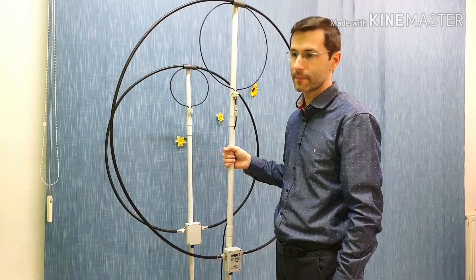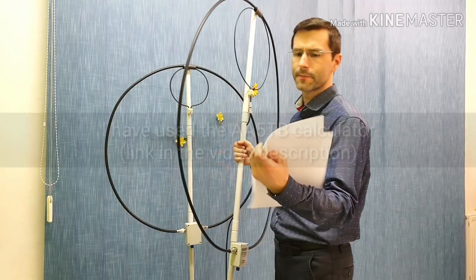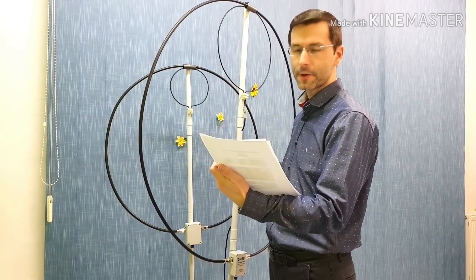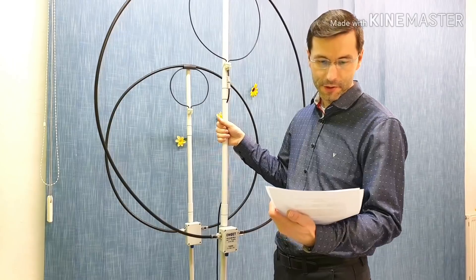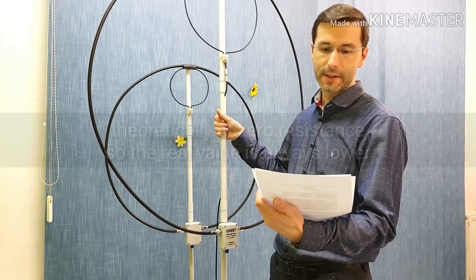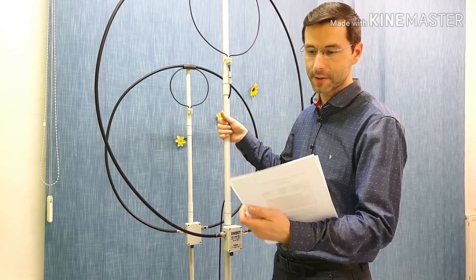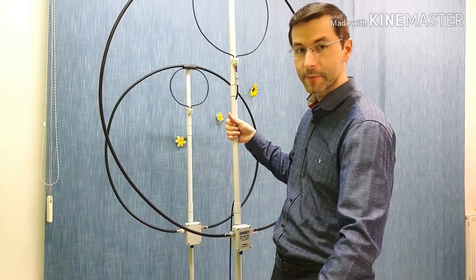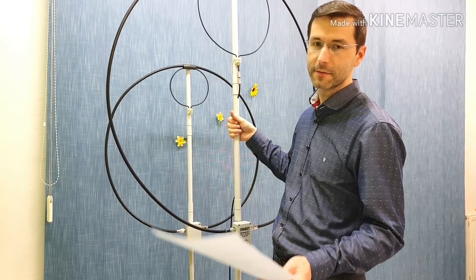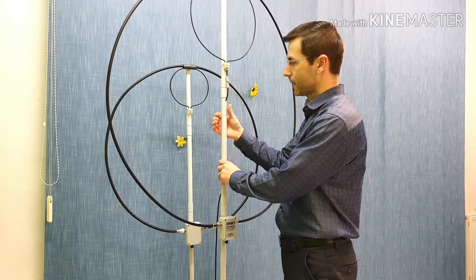The efficiency of antenna version 4 must be bigger because of the construction and the larger dimensions. By the calculations I made on these antennas, at 14.2 MHz the efficiency will be about 97%. That's quite good for 20 meters. And for 7 MHz, so for the 40 meter band, the efficiency will be about 70 to 74%.